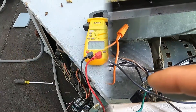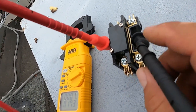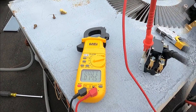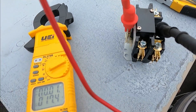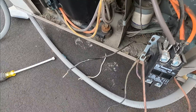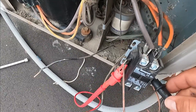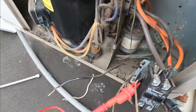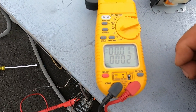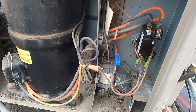I have a new contactor here and we're going to test the coil — just the coil. I'm going to put one lead on one side and the other one on the other side. As you can see, the new contactor coil is reading 17.3 ohms. A contactor coil when it's good should measure between 10 and 20 ohms, and this new one has 17.3. Now testing the old contactor coil — it's reading 0.3 ohms. Not even one ohm. That means the coil has essentially zero resistance and is shorted out. So the coil is to blame for the short.